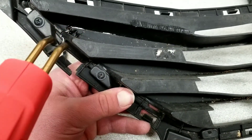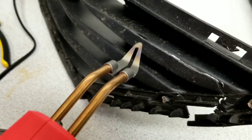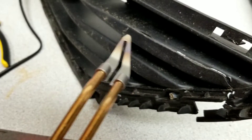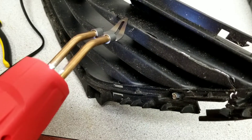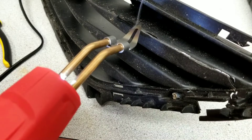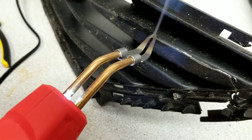When I let go, you can see that everything is held together, but we obviously need to come back through and help strengthen all the other pieces. On the other side, I don't really care how it looks as long as it stays together. Take your trowel, heat it up, you can see it start to smoke, and then basically just smear across it — this helps smooth and weld all that cracked plastic back together. You can see it's doing a really nice job smoothing it out.